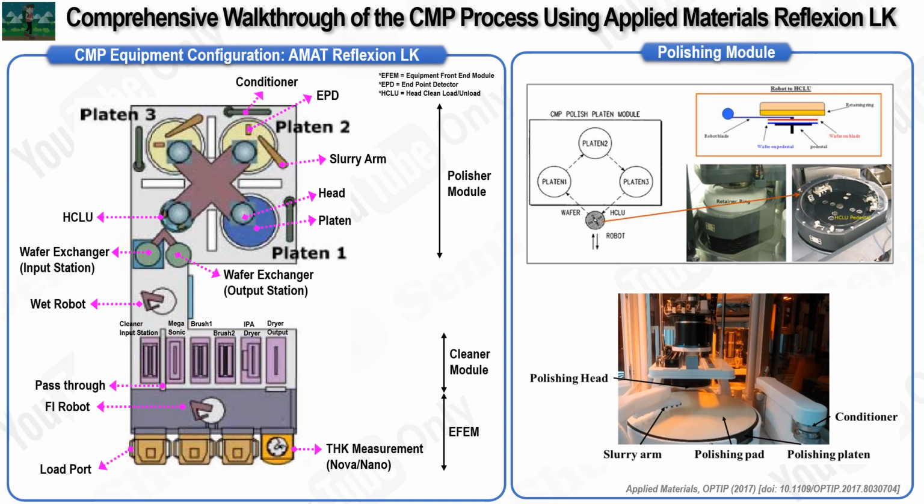Monitoring and detecting the precise endpoint of the polishing process is a critical part of ensuring high-quality results. The endpoint detector, or EPD, window plays a central role in this process. Positioned on the pad, the EPD sensor monitors the reflectivity of the wafer being polished. By detecting changes in the wafer's reflectivity, the EPD allows for accurate control over the polishing time. Adjusting the polishing time based on the wafer's reflectivity ensures that the optimal results are achieved, aligning the process with the specific needs of each wafer.